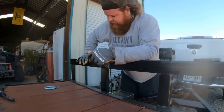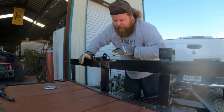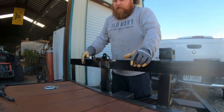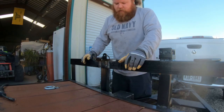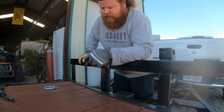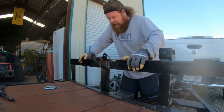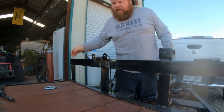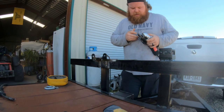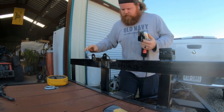Most of my welds turned out real nice. Some of them welding upside down I really suck at, but most of them turned out not too shabby. I look like I got good penetration — I don't think this thing is going to go anywhere. So I'm going to let it cool off, clean it up, and then we'll throw some primer on it and shoot some glossy black paint back on it so it looks like it came that way. I'm going to switch this blade out and cut this off because it protrudes out a little bit, and probably trim up that little gusset as well so it looks better.